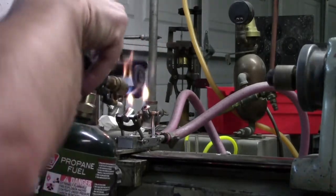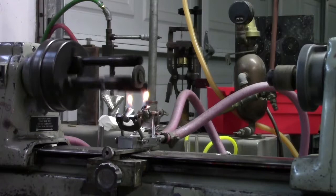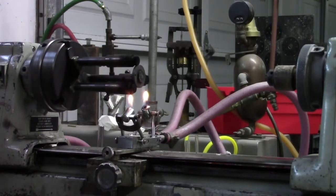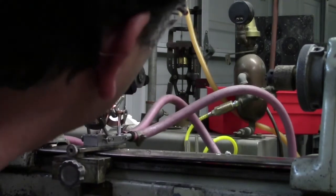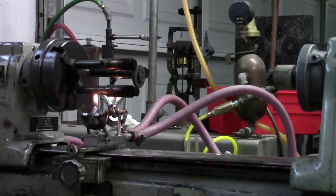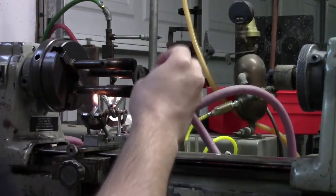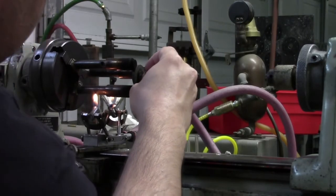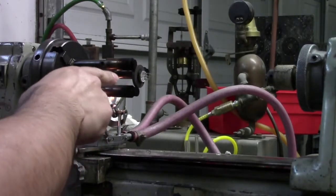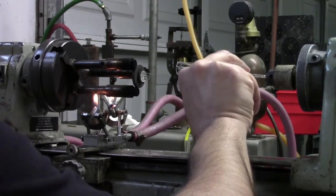This should be hot enough now. We'll go ahead and shut this off and put some gloves on for one side and shut the lathe down. Take the fire carriage a little out of the way so we don't burn ourselves, and position the holder to where it makes some sense. I obviously don't have a glove on — this is a spud so I'm not worrying about poisoning it. Go ahead and get the stem in there. I like to leave a little bit of a gap between the stem and the holder just to allow a little bit of expansion and contraction.